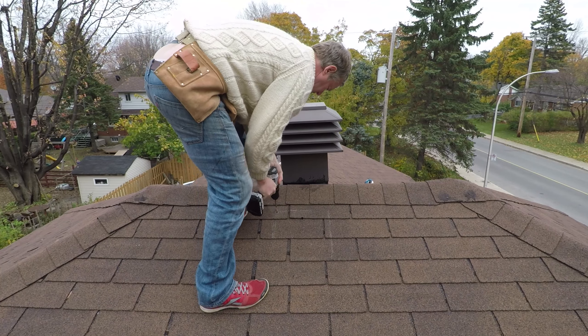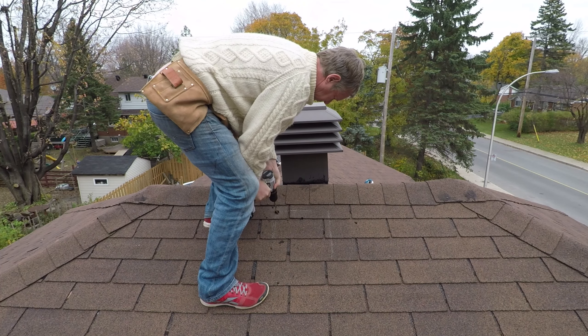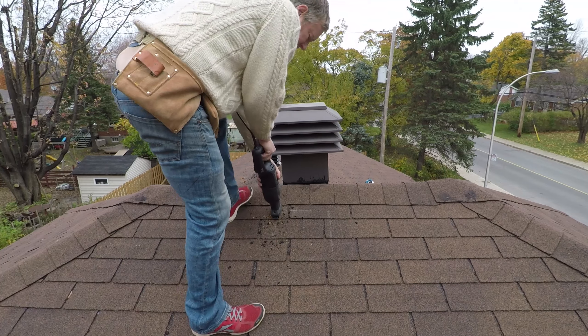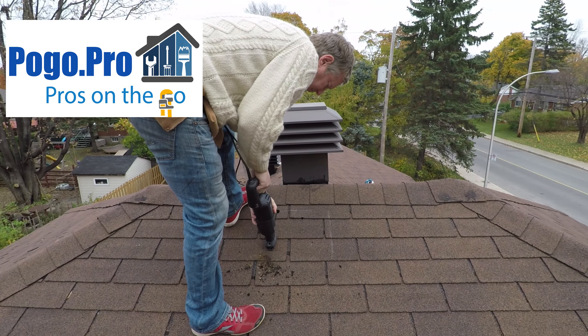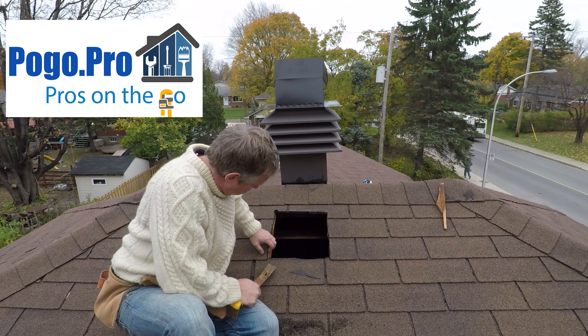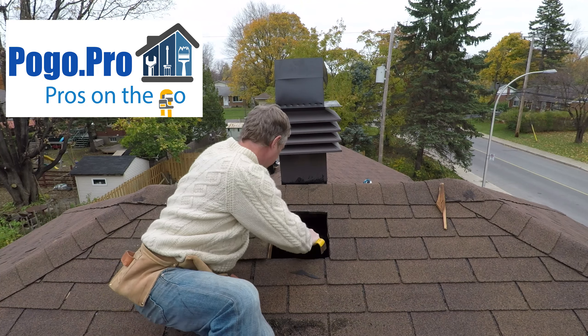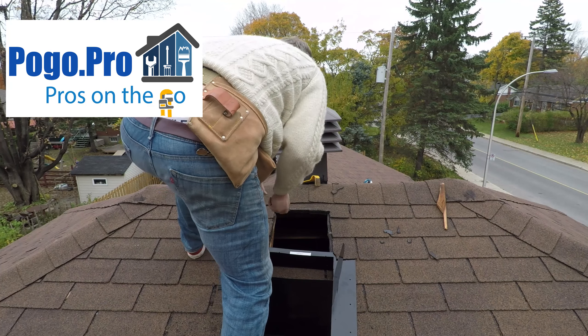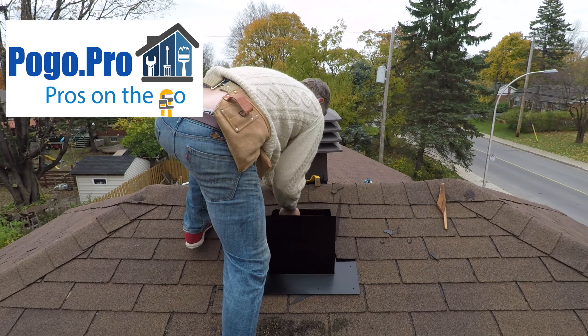What did work was installing additional air vents for the attic. I purchased two high volume vents from Home Depot for about a hundred dollars each. To install them, just cut a hole in the attic roof, lift up your shingles using a pry bar, and slot the new vent base into position.